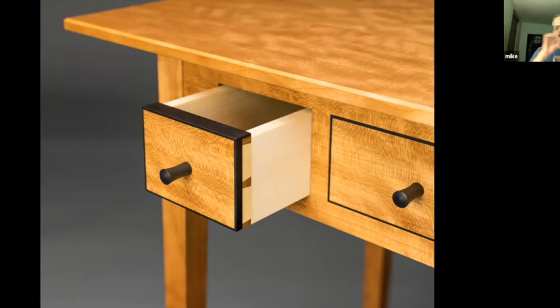I could have done this as an edging detail. I hit a frustrating point in that first hour, but fortunately I worked through it and was pleased with how everything came out. I did think about doing it as an edging detail where I would mill maybe a sixteenth-of-an-inch by sixteenth-of-an-inch rabbet into the drawer front. But I decided I wouldn't like the appearance on the side where you'd see a little bit of edging, some end grain of the drawer front, and then the dovetails starting — I was just fearing I would not like that striped appearance.